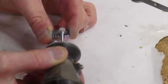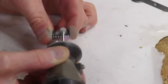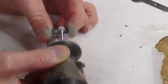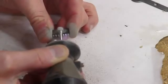Initially I started just using a Dremel to remove a lot of the epoxy package material, but I found that that was very inaccurate. As it turns out, the acid etching process, which I'll describe later, is very dependent on having a uniform pocket for the acid to sit in.